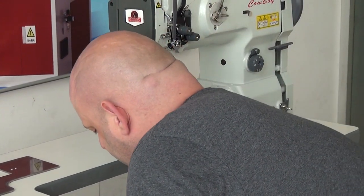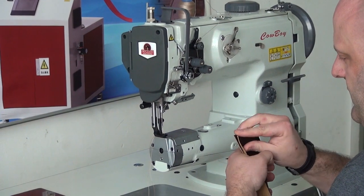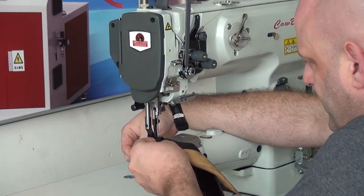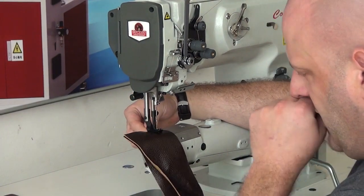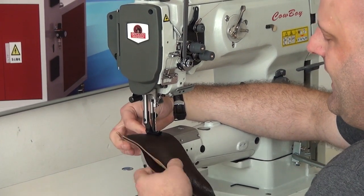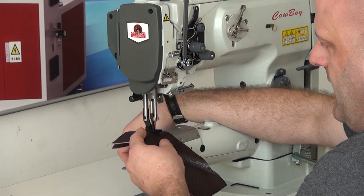Let me grab my material back up again and then we'll go ahead and do some sample stitching so you can see how it works. Again, two layers of three to four ounce creme tan upholstery leather. We're going to go ahead and stick that in the machine. Now I've got this set to an extremely low RPM — this machine could go much faster than this — but I have it set at an extremely low RPM so that we can see the stitching. I'm just going to start sewing here down the piece.